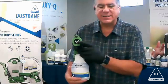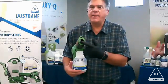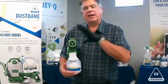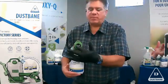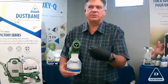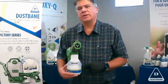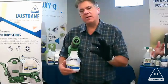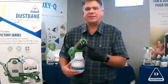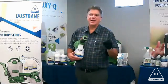So this guy here needs a bit of maintenance. It needs to be looked after. Make sure that these are cleaned weekly. Using different chemistry, some people are using bleach, Unitab. If the Unitab is not emulsifying properly and it's used, it may start clogging the inside of your nozzle. Dip them in soap once a week, and if you need to remove buildups of hard water, use Blue Light Plus, an organic neutralizer, just a quick rinse, quick clean, because that's the key. If that thing was cracked outside the box, you will get a leak. It'll just leak. That is a cracked nozzle. We have to replace the nozzle. And you know what? They're making 20 to 30,000 units daily.